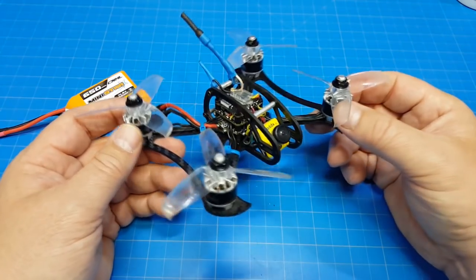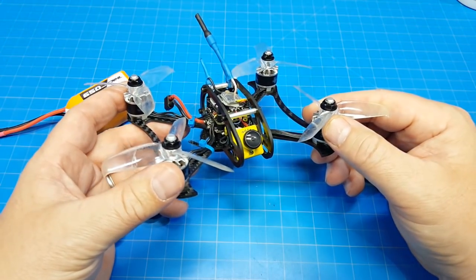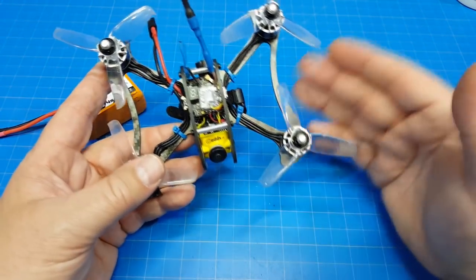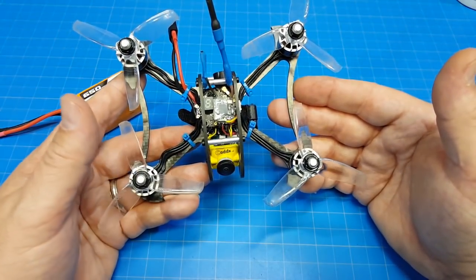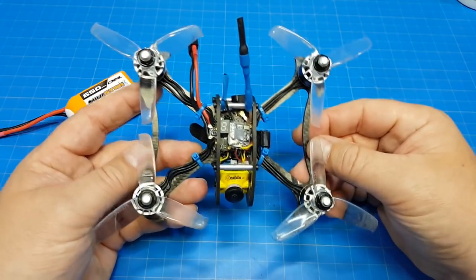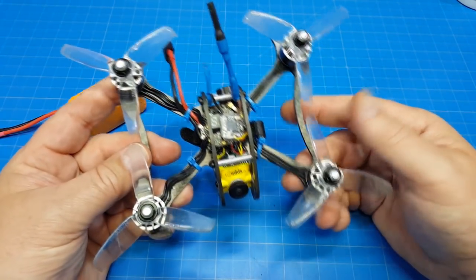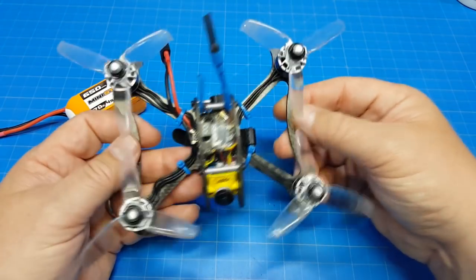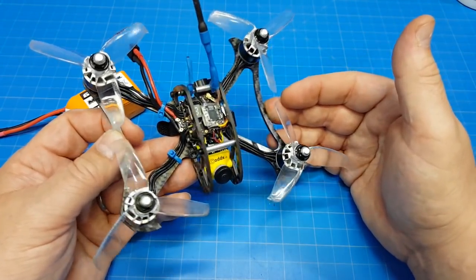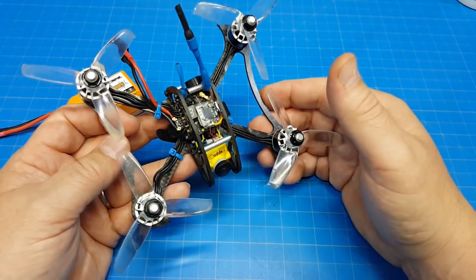So there it is. I don't recommend building like this. Follow the rules on the FlexRC website or the suggested build, and I think you'll have a good time with it. I didn't notice any sort of flight characteristics that threw me off. I didn't notice any PID tuning that was unusual. So I think if you're used to building and PID tuning and flying, this one won't cut you out by any stretch. I'm sure it's got to be in aerodynamics. These cause resistance and therefore technically slow you down in some capacity. How much that is, who knows?